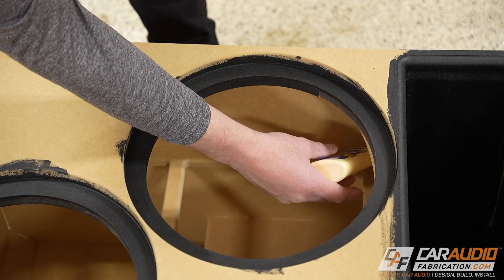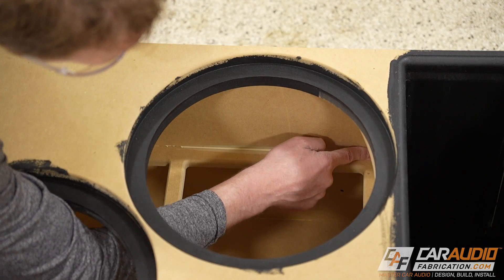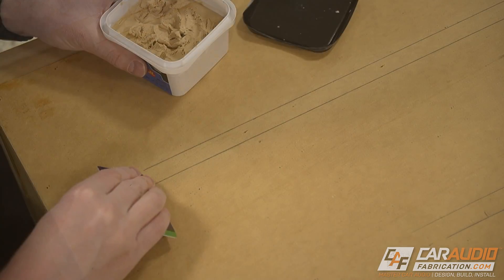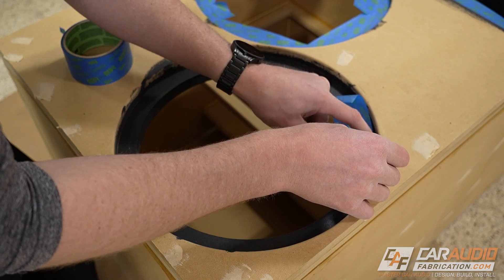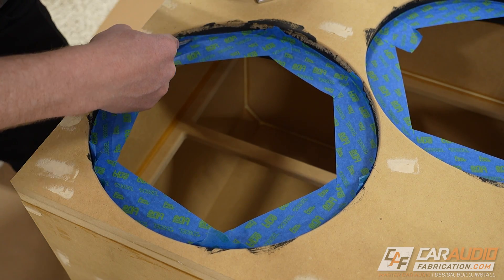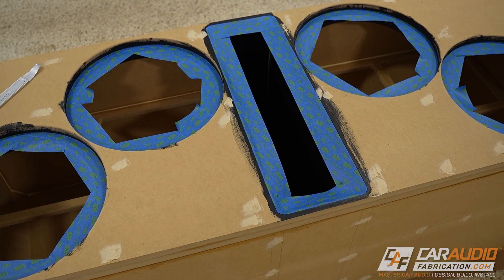Now we need to make sure that the enclosure is completely sealed up. If you did have some larger gaps, you'd want to use caulk, but in this case, since my cuts are so precise, I'm able to simply add wood glue to completely seal all of these edges. Now, if we were carpeting the enclosure we wouldn't need to worry about this step, but since we are applying a paint-type coating, I do want to fill all of these brad nail locations. The paint coating we're going to be applying does have a rough texture to it, and I want to make sure that we get a good seal on the subwoofer baffle, so I'm going to protect this — that's why I already painted it previously in the last video. I also use tape to protect the port so that the port can stay nice and smooth on the inside as well.